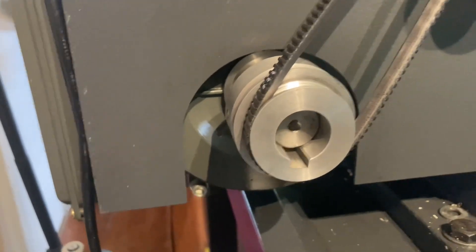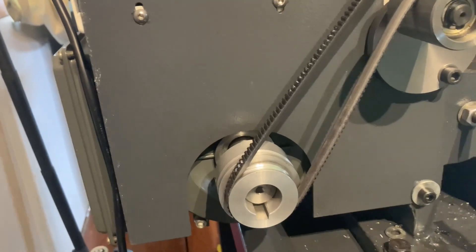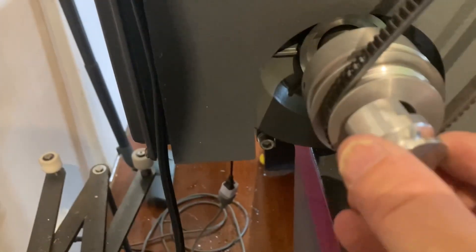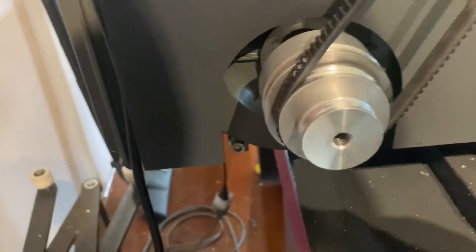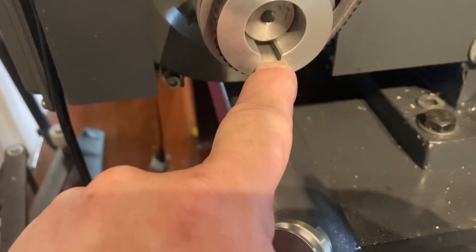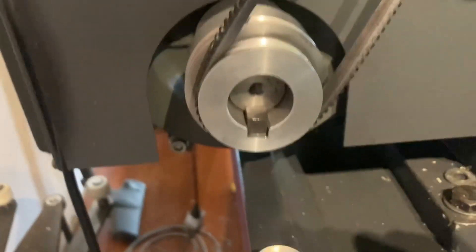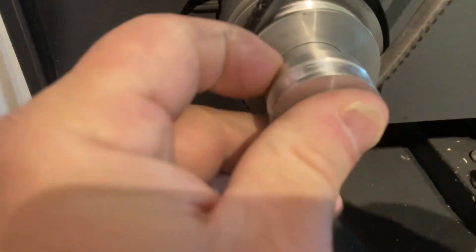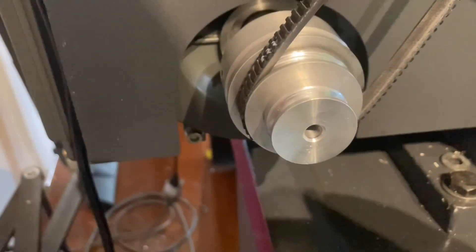This is how the machine came from the factory. The spindle actually doesn't protrude all the way through to the pulley, which actually worked in my favor. So what I did — I made myself a pulley. It actually slides into there and it's a nice sliding fit — there's no play in that. I cut a little keyway into this which lines up with the one down here. I'll just get this little key and put that in, and now I put this pulley back on. That is a really good fit, and having that key there gives good drive and good strength.